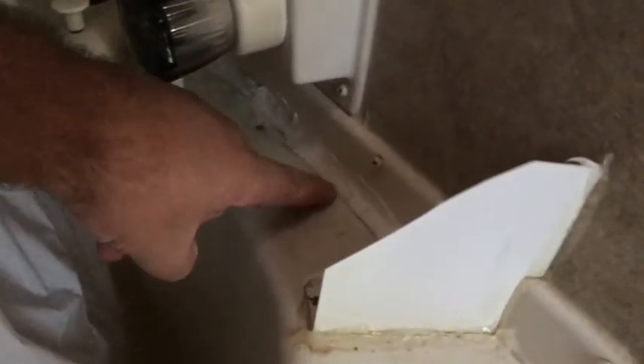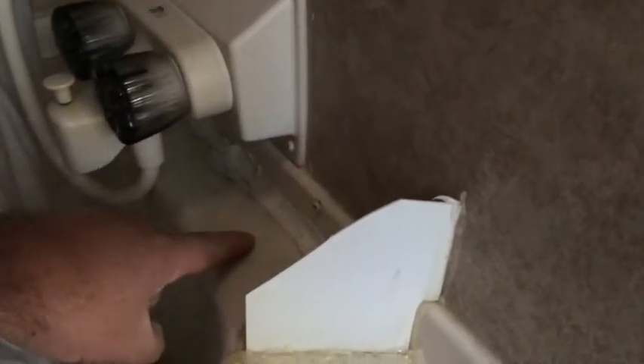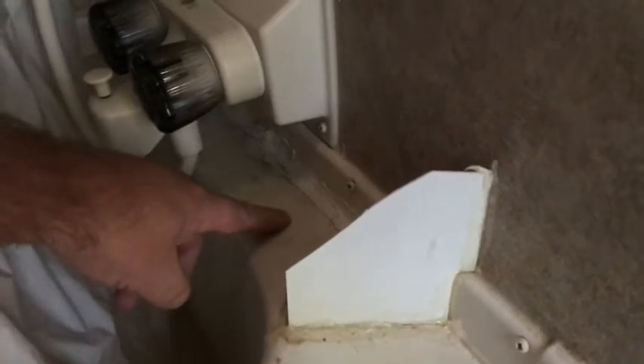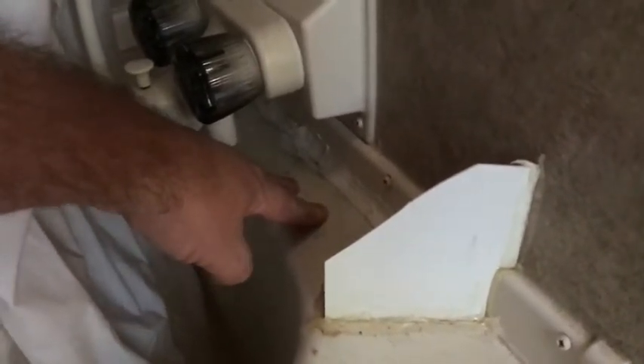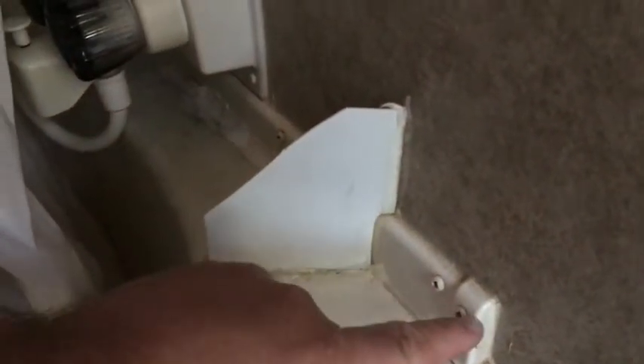Here in the shower, this is where water was constantly dripping out. Now if you see this existing attempt, don't stop the video thinking that's all you need — it did slow the water down but did not fix the problem. The entire lip here has the wrong pitch on it. It's angled the wrong way — it should angle back into the tub, but instead it's angled about five to ten degrees toward the wall, so water runs out instead of back into the tub.